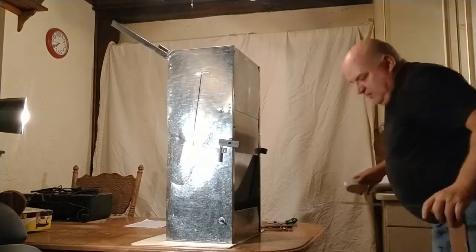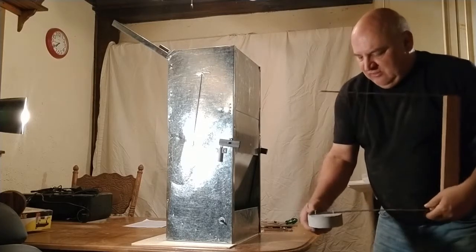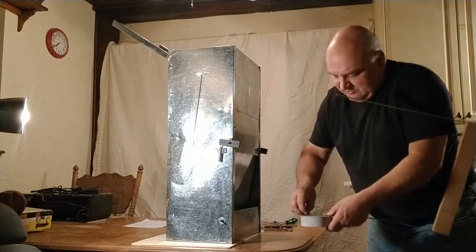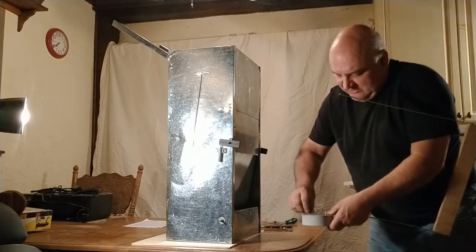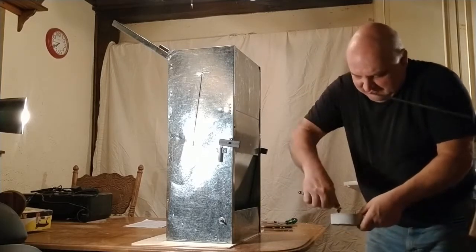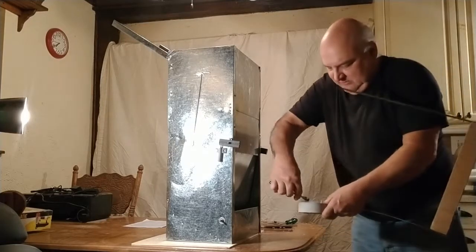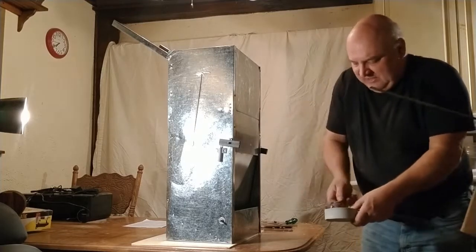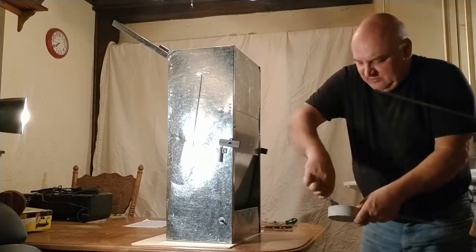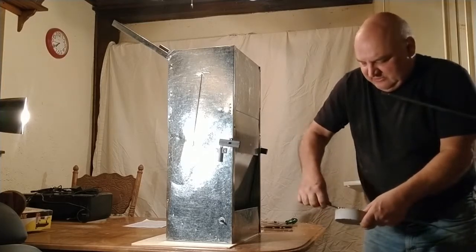Now I'm going to use these concrete weights. You basically stick one through the hole — there's a little pin on top that drops down. Take a lock nut; the lock nuts will have white plastic in one end. The plastic goes on top, meaning the bolt should turn by hand for the first quarter inch or so, and then the plastic will hit it and deform to lock it down. Snug these up — you don't want to over-tighten them and break the concrete. The power of a screw thread is enormous and you can literally break the concrete, so just snug it up good.